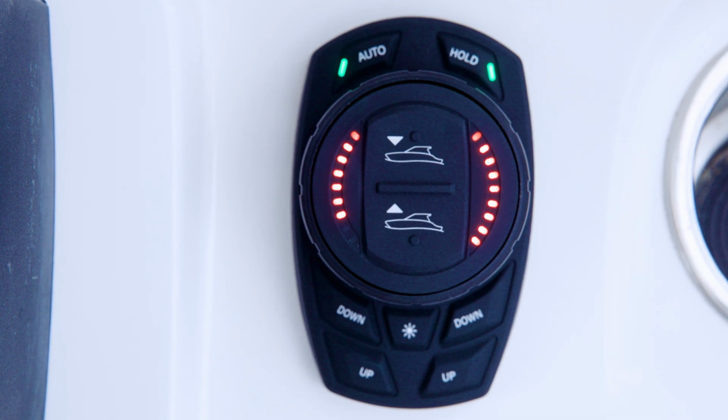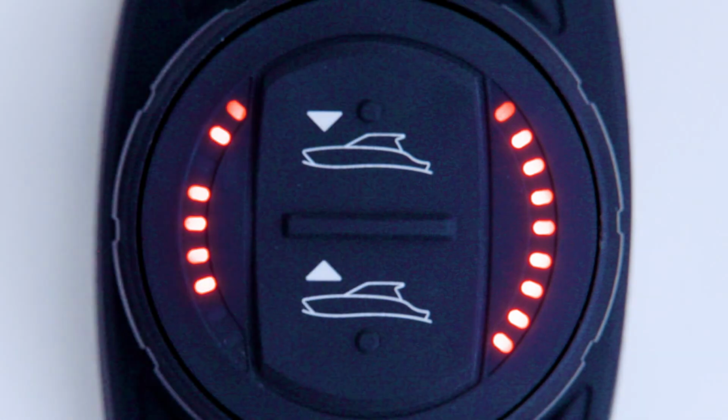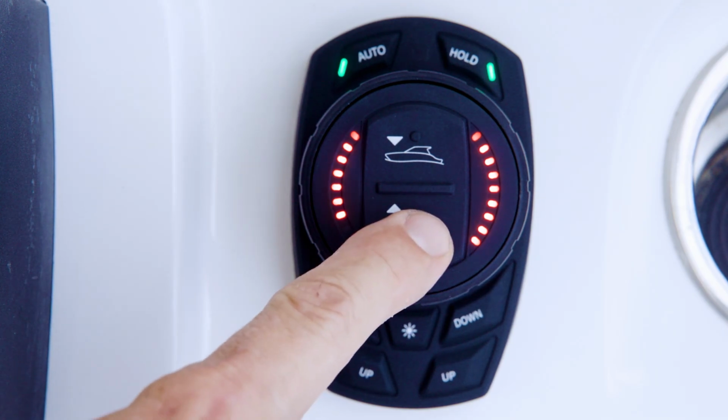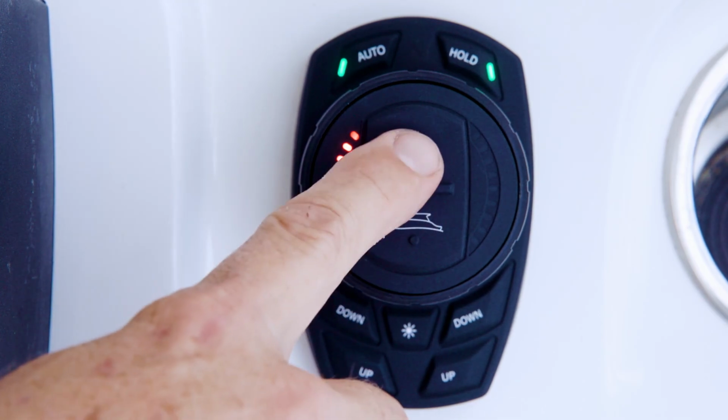There are 9 percentage options as indicated by the LED indicators on the right-hand side of the dial face. In order, each LED corresponds to a greater percentage increment, beginning at 0% tab deployment at a minimum and ending at 100% tab deployment at a maximum. The whole shot intensity can be adjusted by using the all up and all down buttons on the dial face.